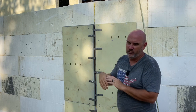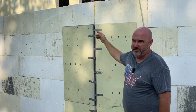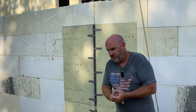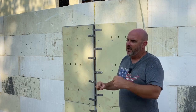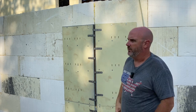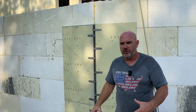We've got the Zons on the inside. This wall is baby stuff — it'll probably be the last thing we pour, a place to burn a little wet load if needed. We're going to have 4,000 PSI concrete coming out at about a 3.5 slump, which is about the minimum slump that plasticizer works at. We'll take the 3.5 and slump it up with plasticizer to hopefully close to a 5.5 or 6. I'll probably be on the vibrator vibrating in the beams up there, and Austin will get up there with me and shoot some video showing how the whole process works.